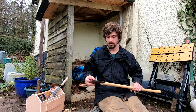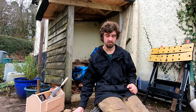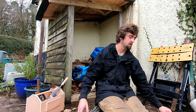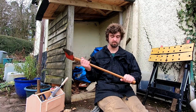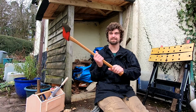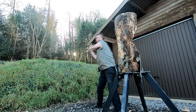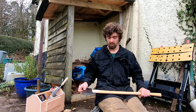So in short, I do like curved handles for most things these days. I don't like extreme curves, but it really depends on the shape. If it's flat, you get fine control, but particularly for felling, with the curved handle, when you put the top hits in, it's less likely to want to twist down and scoop out of the cut. It just stays there and will cut straight.